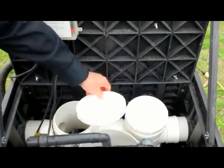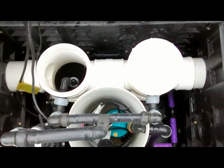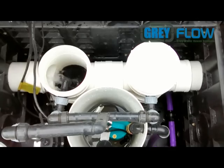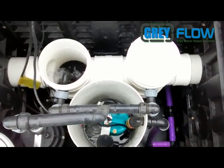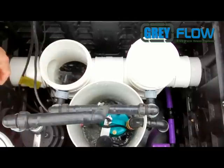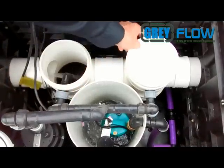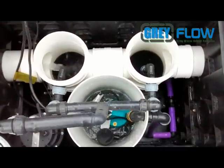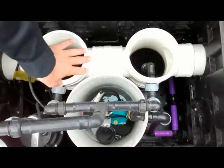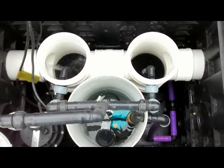When I take off the filter cover here, you can look inside — this is like somebody taking a shower or using the sink in your home. Gray water will start entering the device. Gray water enters and goes down through the filter, filtering out the lint, debris, and soap scum, right into the pump chamber. If that filter were to ever clog up, we have a secondary filter where it would overflow right into that filter and do the same thing, running right into our pump chamber.